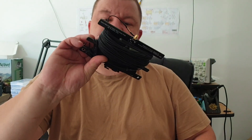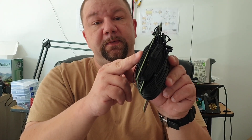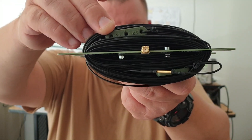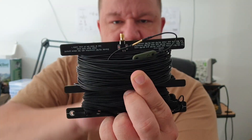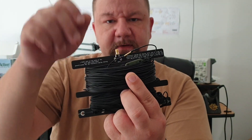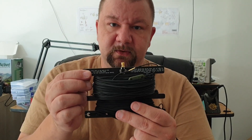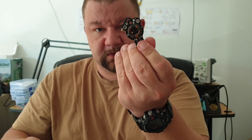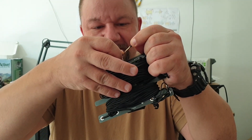And the ready product looks like this. As you can see, here is the wire, and here I have the rope — the beginning rope, the end rope — and here is the antenna wire with all the connectors in between. Like this is the 60-80 connection. And there we can see the triangle that's used to lift up to the pole. It's basically after the 40-meter section that we have the triangle, and this is also the connection between 40 and 60 if you remember the video. I basically just exchanged the wire I built around this broadband transformer, disconnected it, connected it to this PCB, and we're good.